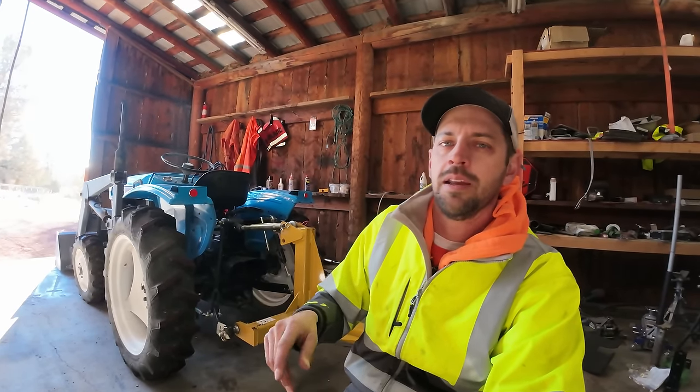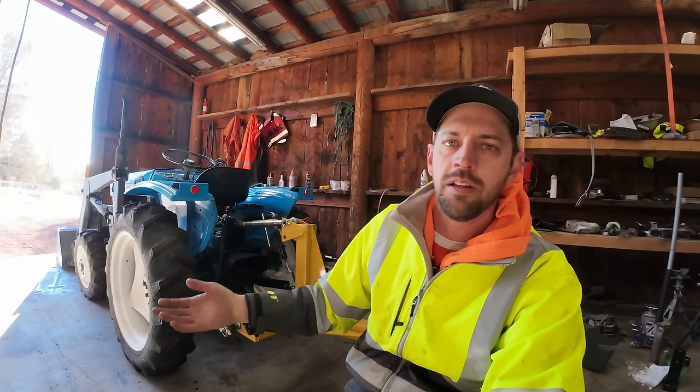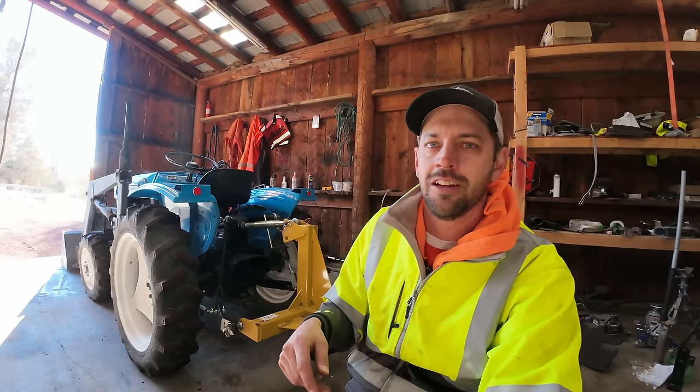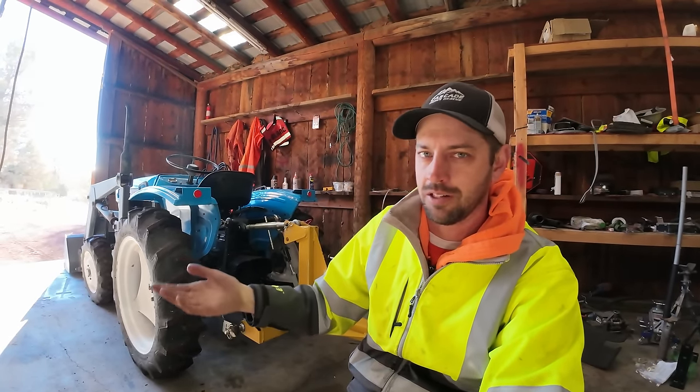And I know a lot of people said, yeah, but when a generator's not under a load, it's barely burning any fuel, so it's not really as inefficient as you say. True, but you're also still putting the same amount of hours and engine revolutions on that generator, so your maintenance intervals and all that are still the same as if it was under load.